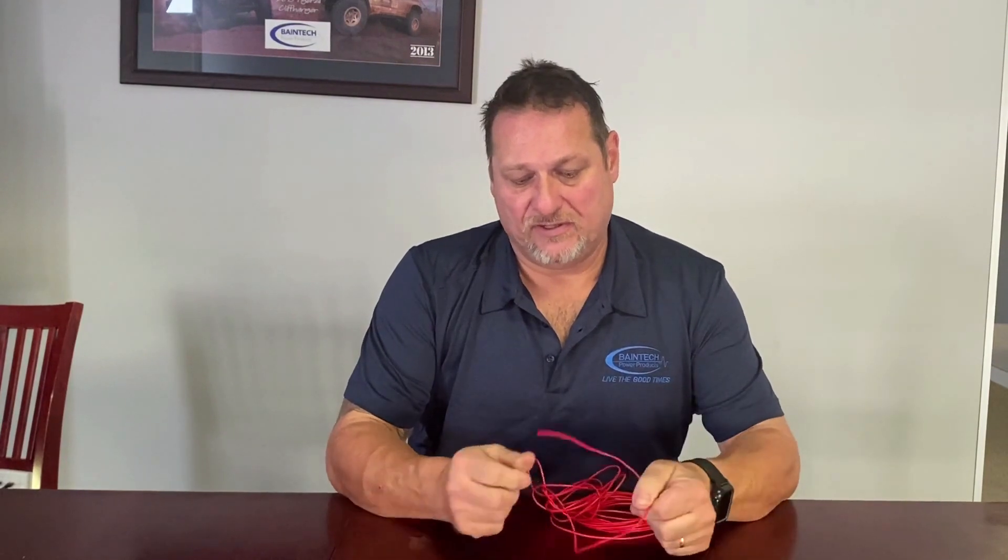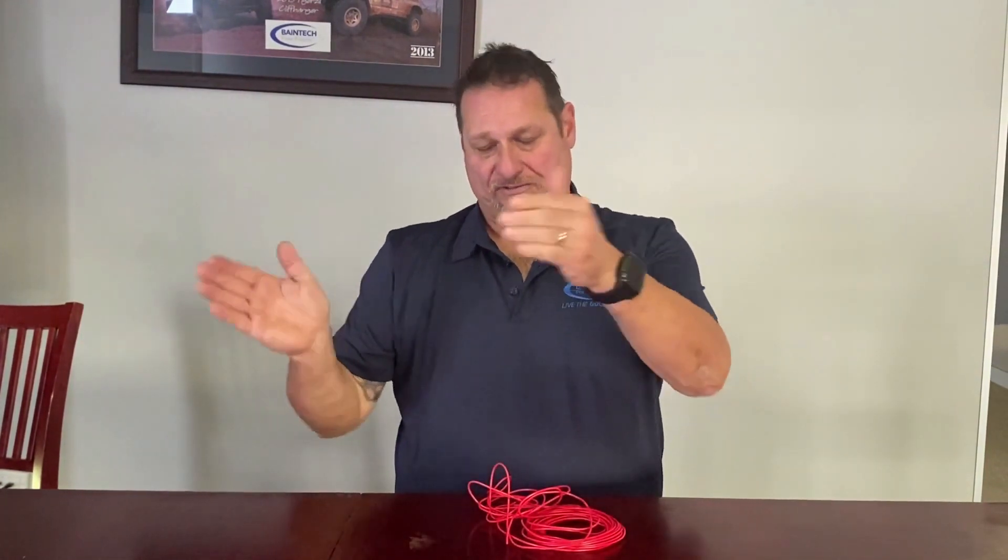This affects external DC-to-DC chargers because most DC-to-DC chargers on the market have a safety feature where they won't output any charge unless they're actually connected to a battery and see a load or a voltage value come back from that battery. This is a safety measure so you don't have live terminals if the charger is plugged in but not connected to a battery, which could cause a spark, arc, or fire.